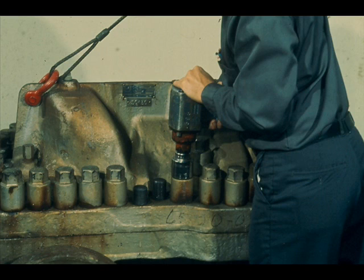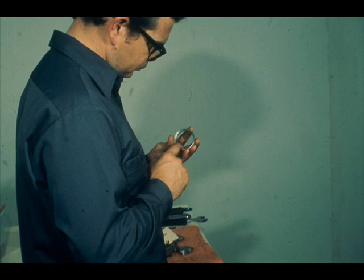During the installation of the thrust bearing, the rotating assembly must be adjusted to its correct running position within the pump case. To do this, the top half of the pump case must be removed. Even though all of the parts have already been cleaned and inspected, some additional insurance may be gained by giving each part a quick inspection as you prepare to install it.